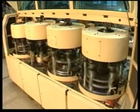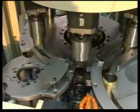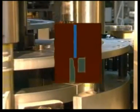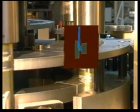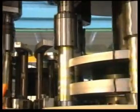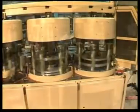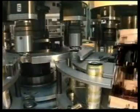When making aerosol cans, the necking in module is used first. The necking in module is used to reduce the diameter, in this case at both ends of the can. Flanging is performed by the spin flanging module seen earlier. In certain cases, die flanging may also be used.